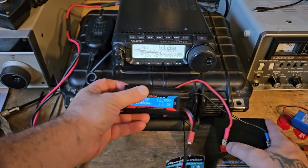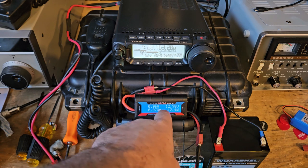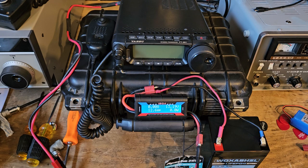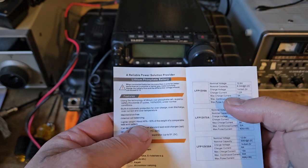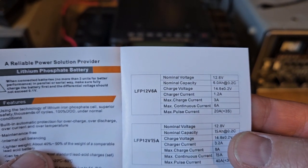It started at 13-something. Let's turn the radio off and see what it raises to. Yeah, it's idly sitting above 13 volts and I haven't charged this battery or done anything with it yet. These batteries are $19 — you can't even begin to build a pack for that price. For $40 you could buy two of these and run a regular HF radio probably at full power for an hour. This one here — the smallest one they sell — will do six amps continuous.